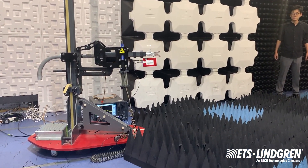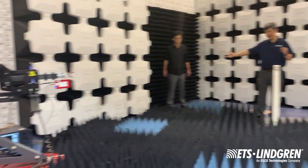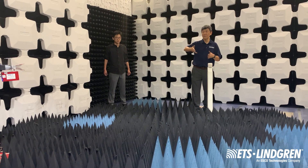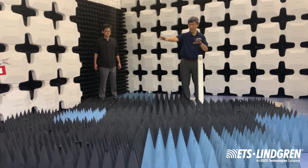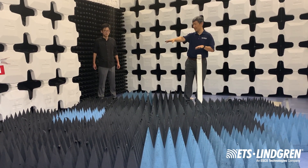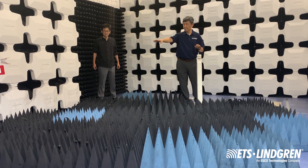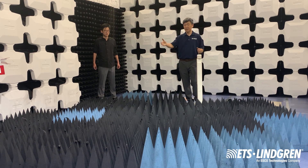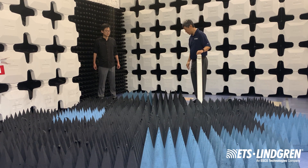It's all set up. We have done the cable-through calibration — Ibo did that earlier — and it's now set up to do an S21 measurement, or S12 depending on which port. I think here we're doing S12. It's got 401 points, but that's pretty flexible — it depends on the test requirement. Right now it's set up to 401 points.